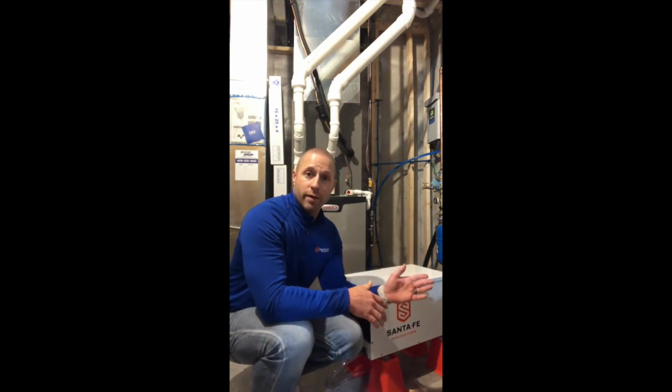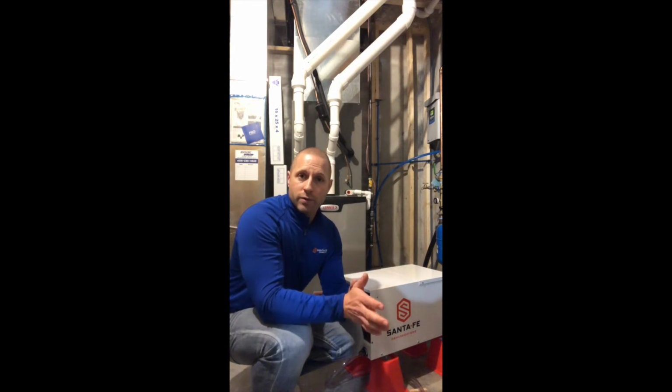Ultra Aire is going to be more of your whole house ventilating type option. So anytime you have ductwork attached to both the return and supply of the dehumidifier, and or you're looking to bring in fresh air at that same time, Ultra Aire gives you that option. Typically it's tied into your HVAC system, but you can also run independent ductwork. It doesn't necessarily need to be tied into the HVAC system.